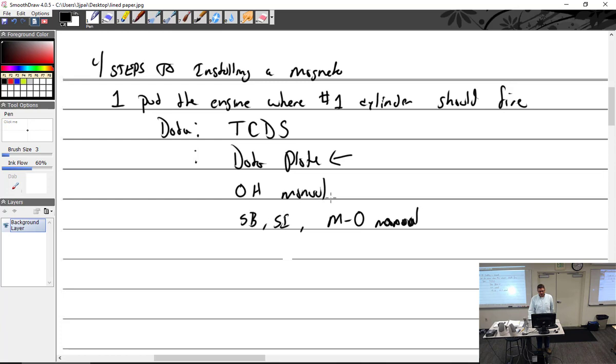Be careful because the Lycoming overhaul manual does not have it. There are directions on how to do it, and it gives numbers like turn the propeller backwards to 20 or 25, I believe, and then bring it forward until you get the right degree. And everybody goes, "Oh, it's a 20." It didn't say 20. It said go backwards to 20 and then forward to the correct number. What is the correct number? You saw 20 and you stopped. So be careful what you're doing.